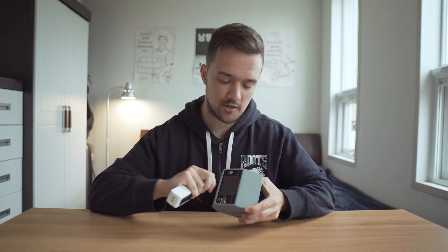When you buy a LiPo and take the brand new battery out of the box, if you were to grab your charger, plug it in, and check the battery's voltage, it would probably read somewhere around 3.8 volts per cell — or about half full. This might seem weird because if you were to buy a household battery for your TV remote, you'd expect it to come fully charged. However, this isn't a mistake, and you didn't receive a faulty or old battery. Selling you the battery at this particular voltage was very intentional by the manufacturer, and is what is called the battery's storage voltage.